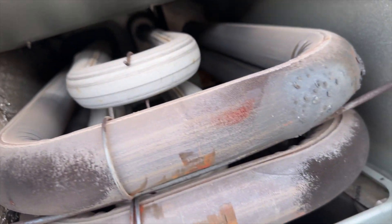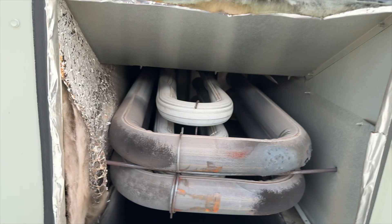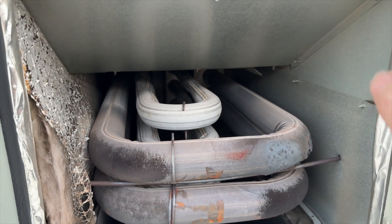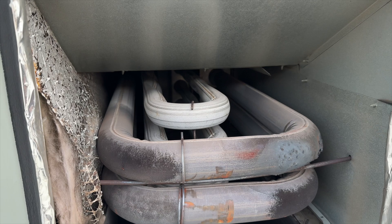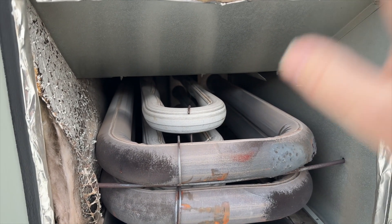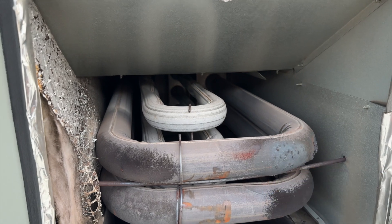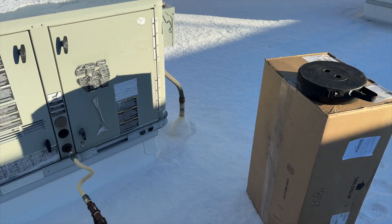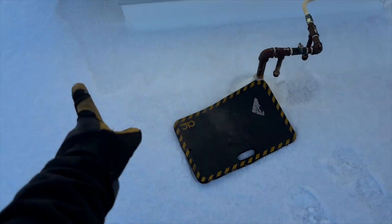That's not good, so I've got to disable the heat — that's a bummer. Anytime you put in a new gas valve or new furnace and set the gas pressure — I know you're going to say it's set at the factory — but if the incoming gas pressure isn't the same as what it is at the building you're installing it at, it doesn't matter. Set the gas pressure every time.